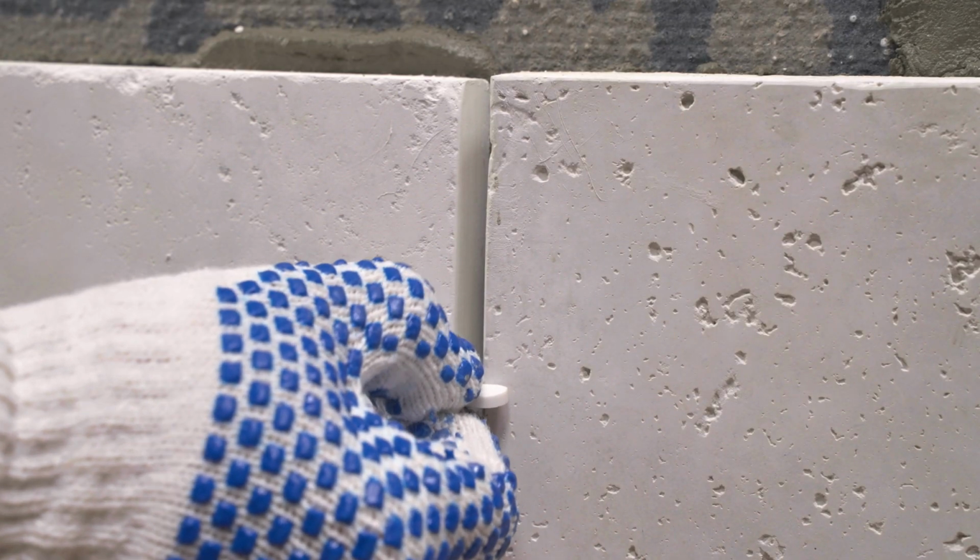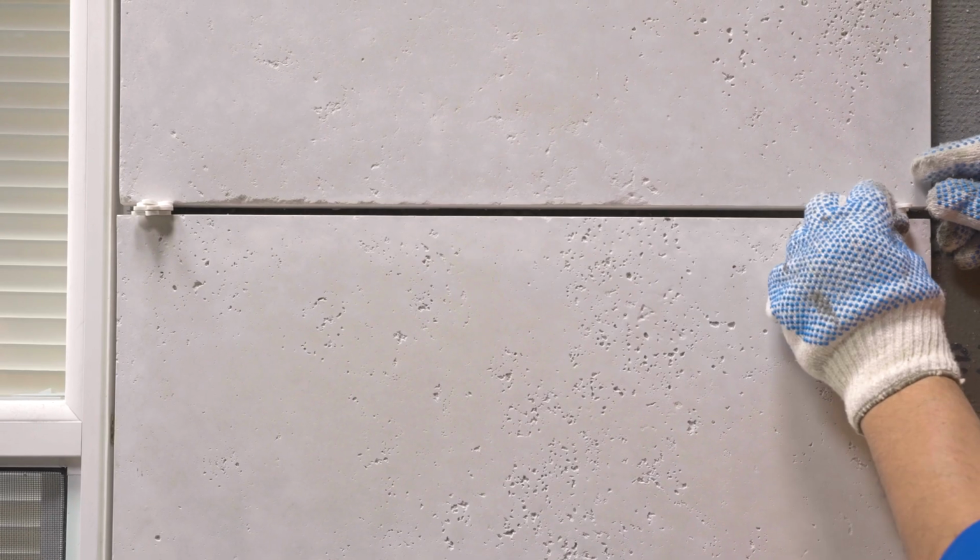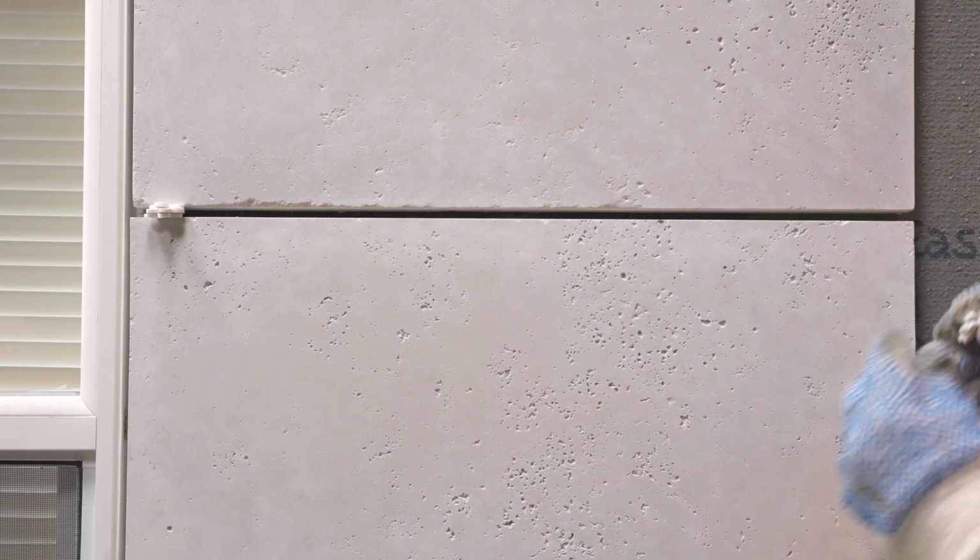Many of these large format stones are laid with a mortar joint. While a joint can be as small as 3/16 of an inch, that dimension is difficult to completely fill with mortar. For that reason, consider a larger 3/8 inch minimum joint gap. To maintain uniform mortar joint gap during installation and curing, spacers are often used. Add spacers for all 4 sides during install.